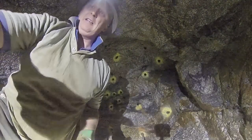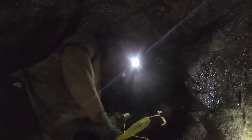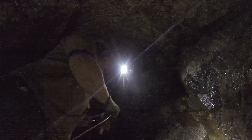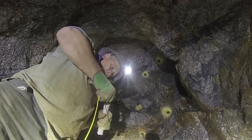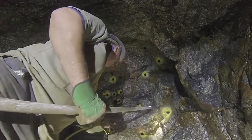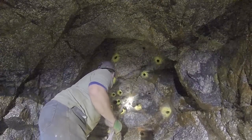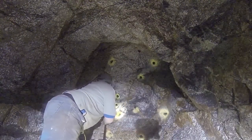And if you pass me the detonator. Zero delay. This is a non-el detonator, non-electric. We've got a bit of water dripping here, so it's always useful to use a non-el detonator. The detonator goes in nice and tight. And then you use a charging stick, which is made of wood, and this pushes the dynamite into the hole. You can fire this hole here. Zero.